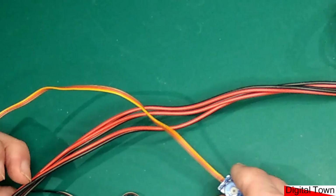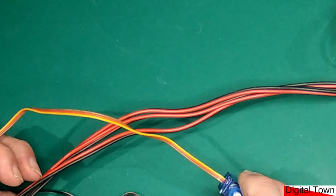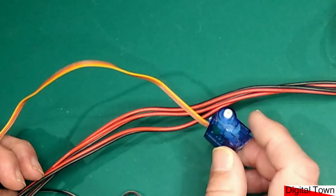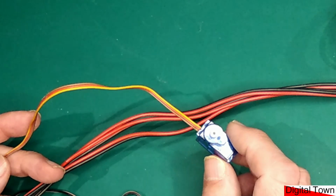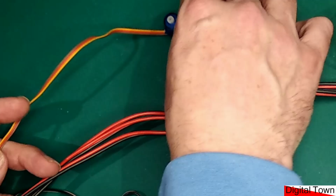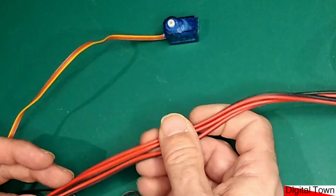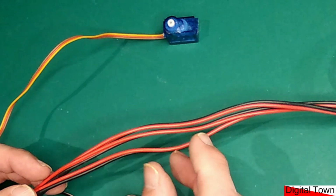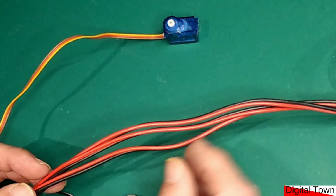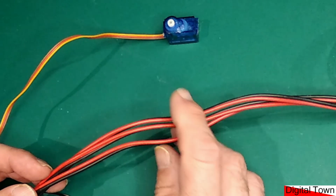And it's just one of those things that when you're building a project, something like that may not come to mind immediately, but it's a case of remembering where the power cables are running and where the signal cables are running. If you've got something carrying a signal, especially like these where they're changing on a pretty even basis and there's a lot of them together, that can actually cause a huge amount of electromagnetic interference.